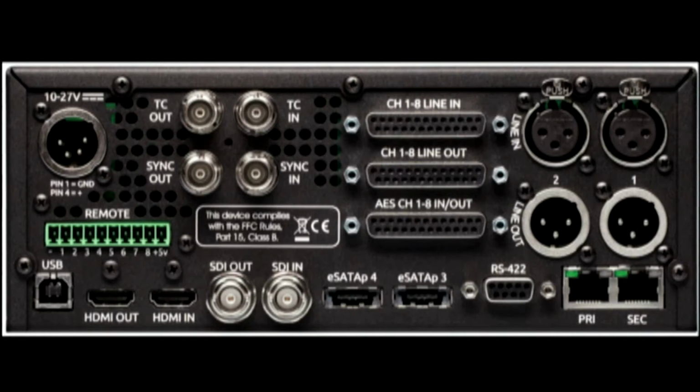So, in routing audio from the Yamaha to the PIX, I know a lot of you are familiar with the Yamaha, but some of you aren't. The MY16 card is just 16 channels of input and output. Whatever you want to send to those inputs or outputs is all done in the Yamaha. You can assign mix buses, aux buses, direct outputs, inserts, whatever you want. And once that hits the Dante card, it's then available on the Dante network to the PIX.